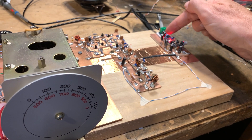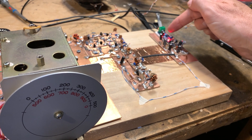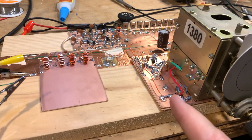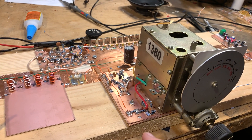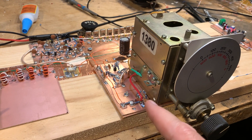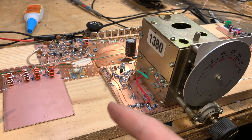I've modified it — changed the capacitor across pins 1 and 8, taking it from 10 microfarads down to about 5 microfarads just to get the gain under control. On the outside of the VFO from the FT-101, I had to build a little zener and voltage divider network here to take it from 12 volts down to the 6 volts required by this rig.